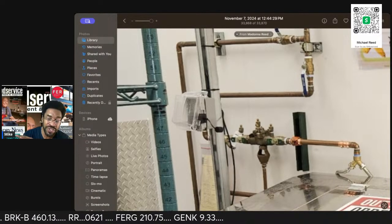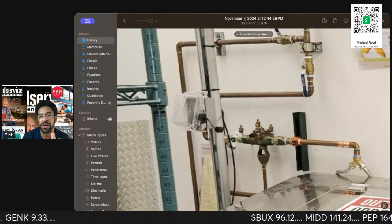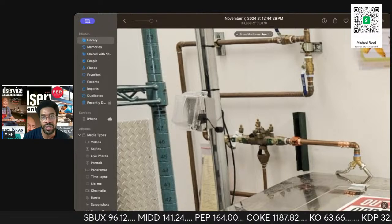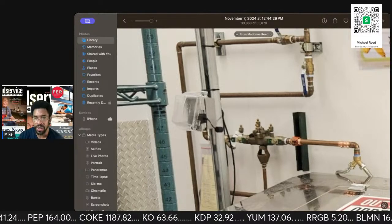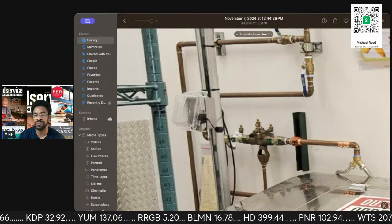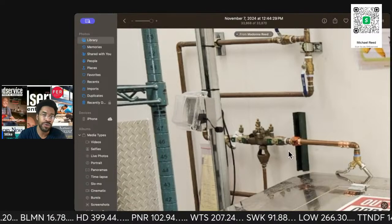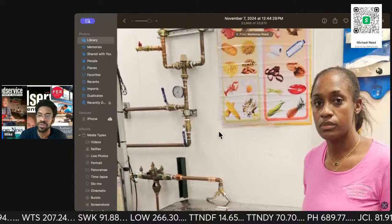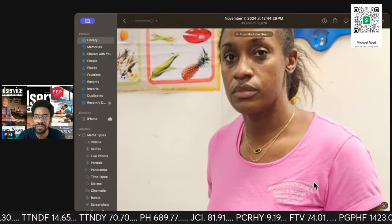If it's not a new location, they're going to require these on any of these water thirsty appliances. They can actually air gap the whole building, put a backflow preventer on the main water source, but most times they won't. So even with what my sister's doing, yep, she got the company. Look at it, looks like there's a company name.